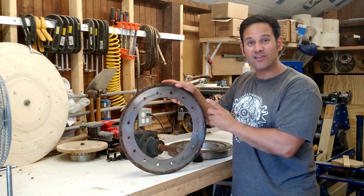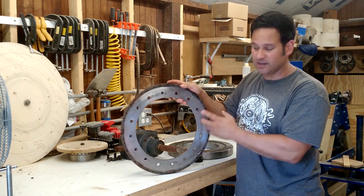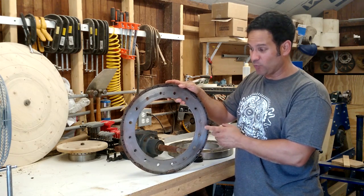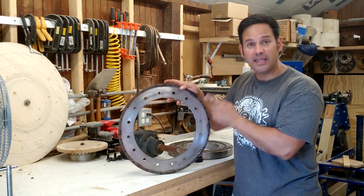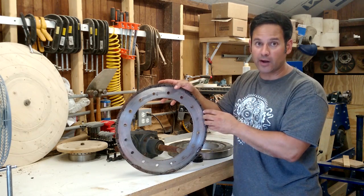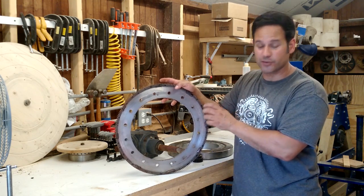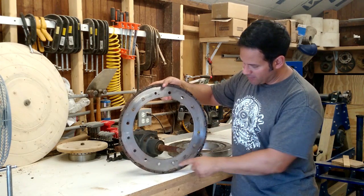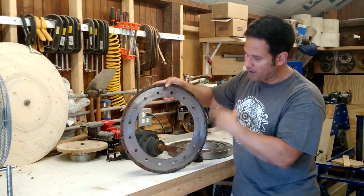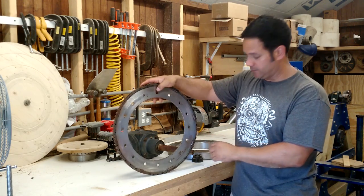This ring gear is a ring gear out of, I think, an old Cadillac. It's a big ring gear — one of the biggest you can get for automobiles, as a matter of fact. I got it on eBay for very, very little — I think I got it for $15. And I welded it onto this plate. It doesn't have a lot of welds, about a 1-inch weld in about 8 or 10 places, but that's plenty strong for what I needed.